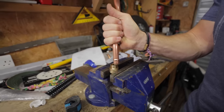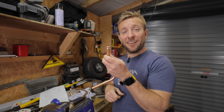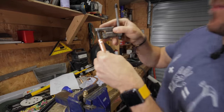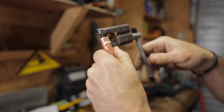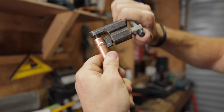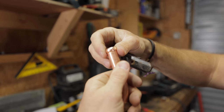You pull the pipe out of the way and move it back a bit if you can. This thing here is called an olive cutter — you can get this on our Amazon store. What you do is pop it onto the pipe, get the blade up against the olive, and do it up like this. What it does is pin the olive and cut it, but it won't really damage the pipe that much. Wind it off again — look, the olive is moving already. And then you can wangle that off.